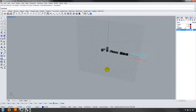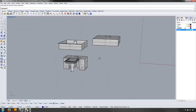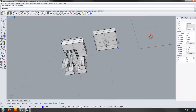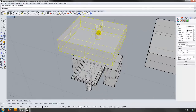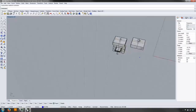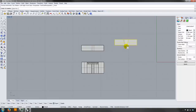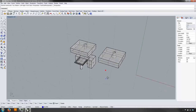Let me go ahead and remove all this extra stuff. So I've split it — what used to be a solid is not a solid anymore. This piece incidentally is still a solid. To fix the other, I'll just cap it, which gives me a nice closed surface. This piece of overhang that's left — I don't want that — so I'll delete it and cap this. Now these are all solid. Remember, this is the stuff I'm actually going to be pouring, and when I put all these pieces together that's going to give me my model back.